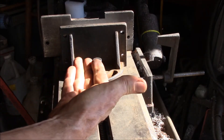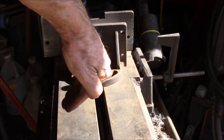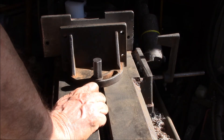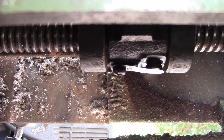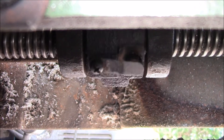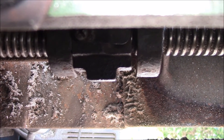That half nut swings around and locks up tight — it was hanging down and now it's twisted around until the tab hit that little screw and it jams in there tight. Then the threads engage and you can push it tight. Here are the vise jaws from underneath — you can see how that half nut is loose there and I can slide the movable jaw either direction. Now I'm turning the hand wheel to tighten it, and there — the tab has hit that screw and now it's tight.